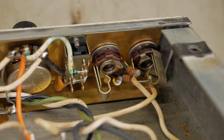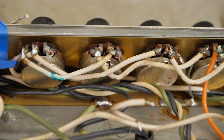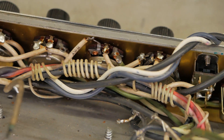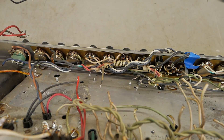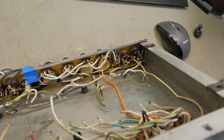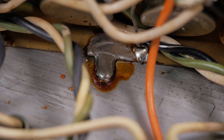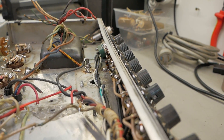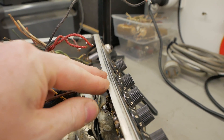I might remove that brass panel and clean all the crud off behind it, because you can see this spray residue - a lot of techs, without knowing anything about board leakage or scratchy pots, just throw liters of WD-40 at everything, which is not a material you should be using. We can probably remove all those pots in one big bank, take the plate off, and keep stuff together to minimise reassembly time. We'll need to get the big soldering iron out and break those solder connections to the chassis. This one's also copped a hit on the front, which is quite common on these.